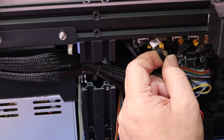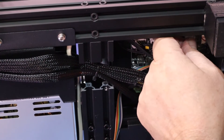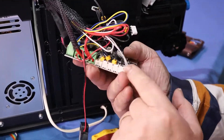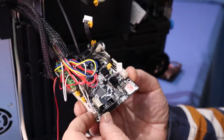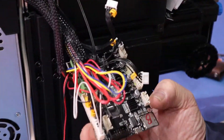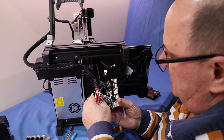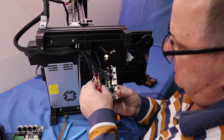Now we're going to need to unplug everything — just pop these plugs off. Out of all the cables here we have two that aren't labelled: those are our temperature sensors for the hot end and for the bed. They're not marked, but the white is the hot end and the black is the bed. The others are the limit switches for the three axes and they're all labelled, so that makes them much easier.